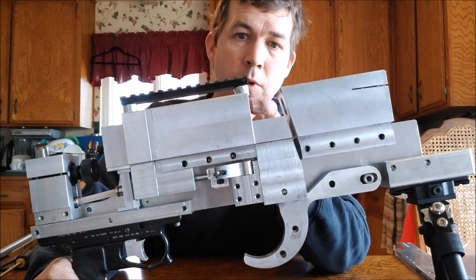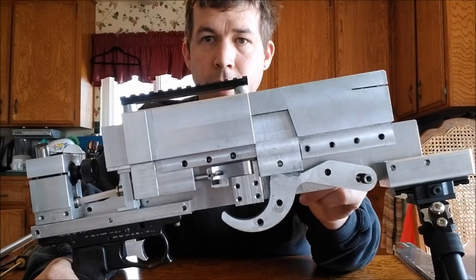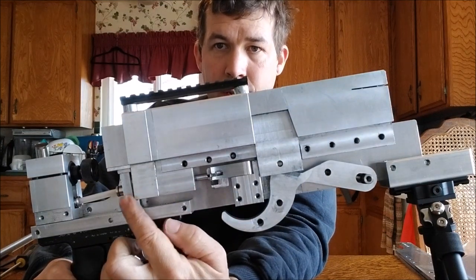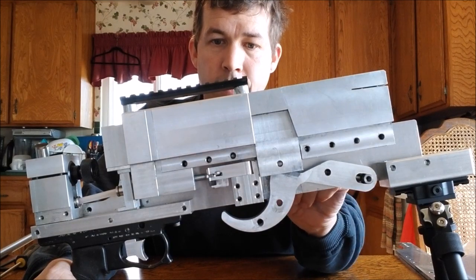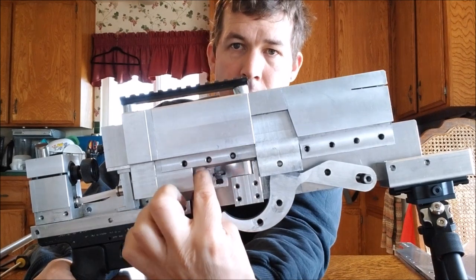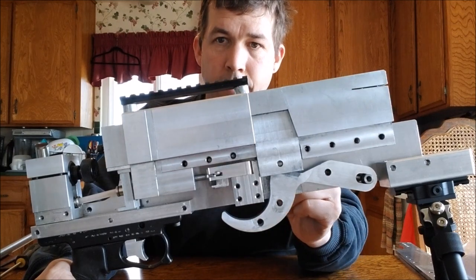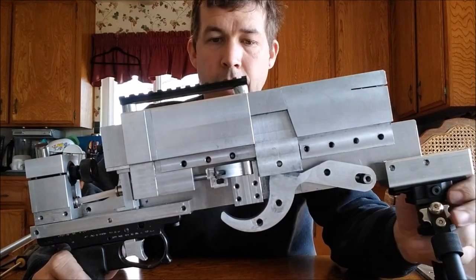The operation is pretty smooth — I just need to put a little more grease on it. The recharge handle, when pulled from this side, actuates and pushes a pin. That pin slides back and opens a valve that adds pressure to the gun. There's no pressure on the valve right now so it doesn't spring back, but when the valve is under air pressure this pin will spring back up to close again. It's a poppet-style valve.